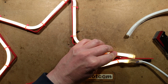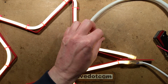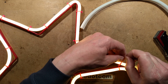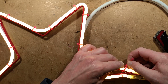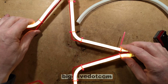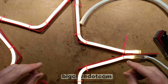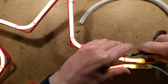That completes this neon star. We'll terminate this stuff and even take some of it to bits to see what it's like inside. The ambient temperature of this material relative to ambient is about 14 degrees Celsius above ambient, so it runs very cool. They say you can run quite a length off one end cap, but I'd recommend keeping it shortish — just a few meters per 12 volt supply.